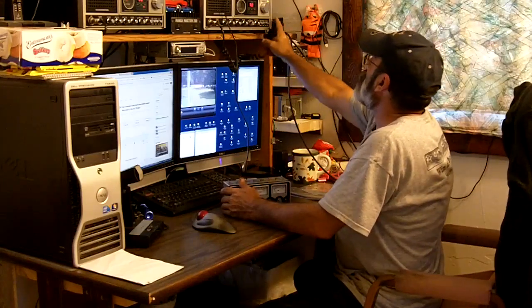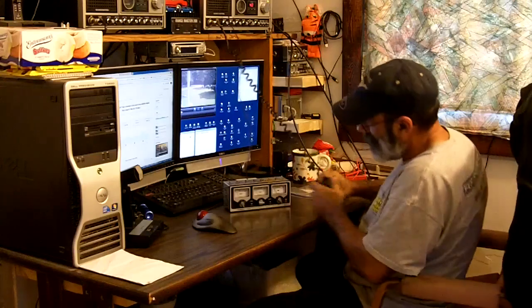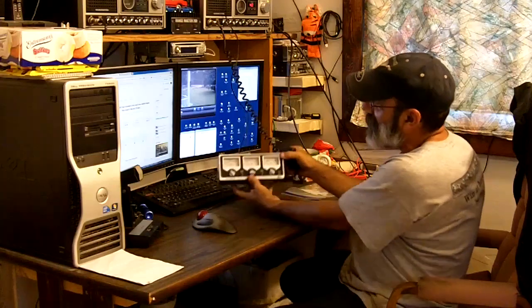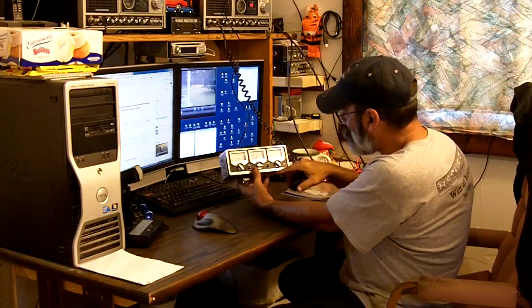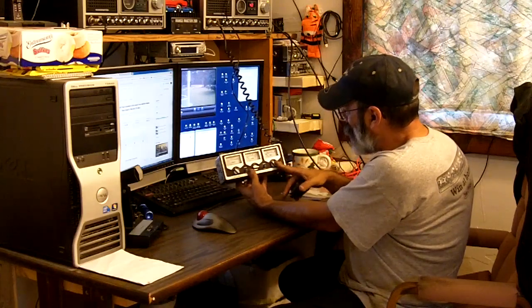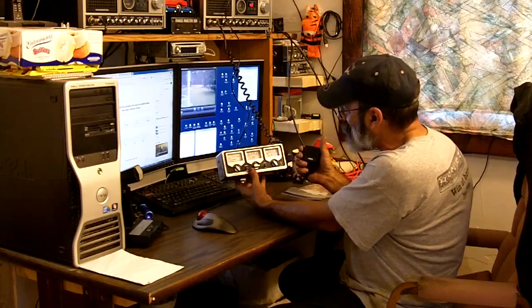Well, the radio will still work with the meter connected. Let's go to AM and we'll try channel 40, and I'm going to shut that one off just so we don't interfere with it. Now let's see, this is just the radio, so we're going to set it to the 5 watt scale. And yep, the needle goes backwards. Let's try the SWR. We'll set that all the way over, as far as it'll go. That way that needle should jump up some. And we got nothing. Matter of fact, the SWR meter is also going backwards slightly.